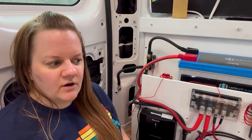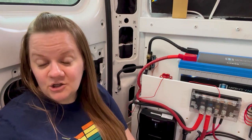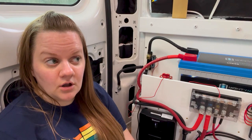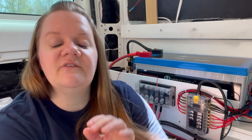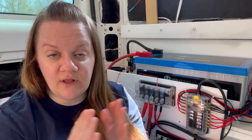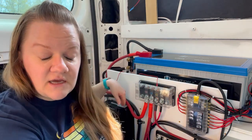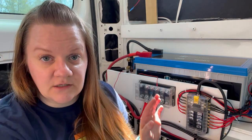So when we're talking about solar power, the big debate, it is hotly contested on the internet. I am not saying one way is right or one way is wrong. I am just gonna tell you what I have done and why, and you are welcome to do your own research. To me, this was the most logical for what I am doing, but that is not to say that it is the right way for everyone. So the reason that I have decided to wire these in series versus in parallel is because even on days where I'm not getting peak efficiency, or even days when I have maybe a little bit of shade on my panels, because when you wire them in series, it adds together the voltages, it's going to keep the voltage high. The reason that's important is because it's going to be easier then for my charge controller to feed an appropriate level of voltage into my battery system to charge it.